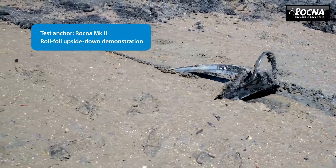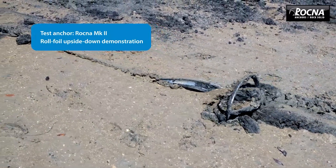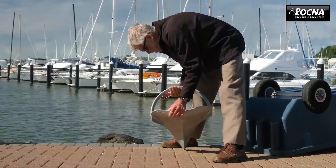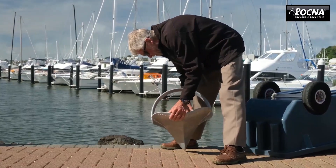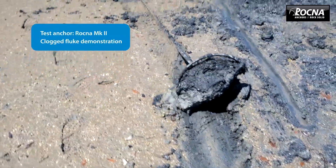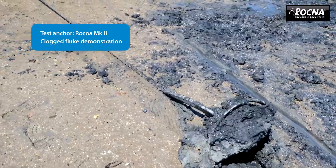But in that position, when the anchor is going down, you can see the foil shape. Number one, it's helping clear the mud flakes and stopping choking between the roll bar and the actual shape of the blade. But it's also putting a downward force — it's actually helping drive the anchor down.